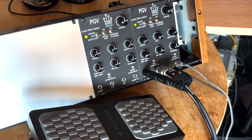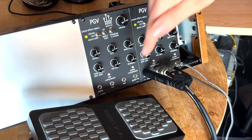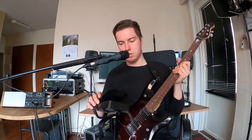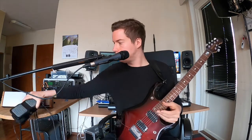There are four 3.5 mm jack connections in the module, down here in the lower part. The guitar in and out are mono tip sleeve jacks, while the pedal and microphone jacks here are 3-contact tip ring sleeve jacks. Use only an expression pedal that has the potentiometer slider output at the tip of the TRS plug. For example, in our case with the M-Audio pedal, remember to switch it to the M-Audio position. The dynamic vocal microphone input jack has the hot signals at the tip and ring contacts and a grounded sleeve. For a common XLR microphone connector, you need to use a proper XLR to TRS adapter.